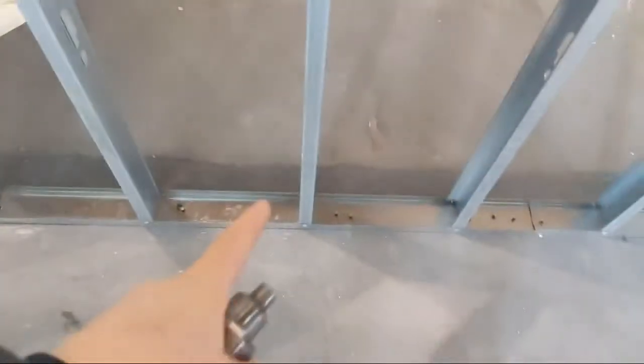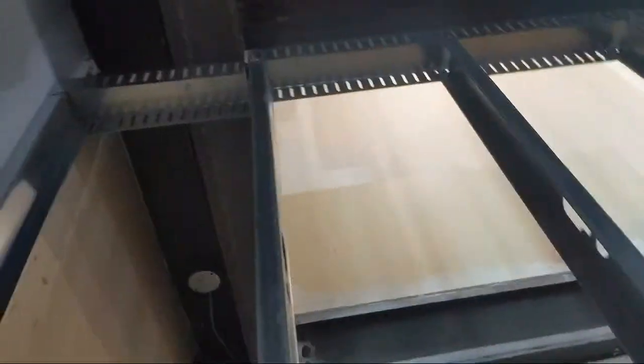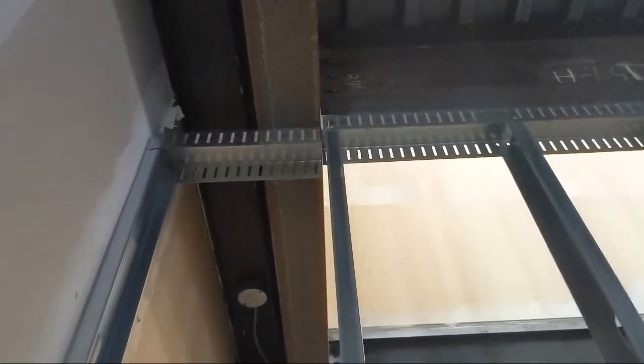And I used the Hilti DX351 to shoot this stuff in. I got concrete pins in the concrete, and steel pins in the steel up there. You can see every 12 to 16 inches, there's a shot. Over here, same thing. You just carry it underneath the beam and over, because you need backing in there for the drywall. And then I got the columns covered there. All the beams will be covered.